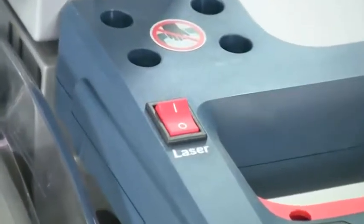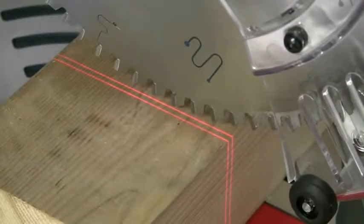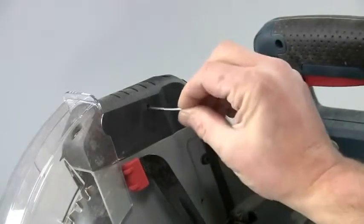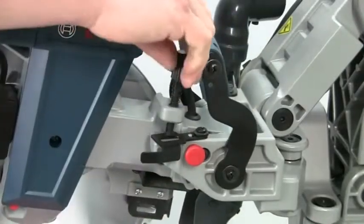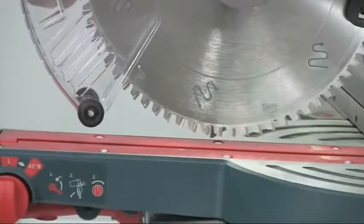To help line up the cut, an adjustable dual laser integrated into the upper guard projects two sharp lines across the full width of the cut to indicate either side of the saw cut. This is so much less confusing than the more normal single line, and you can adjust the spacing of the two lines to account for the different kerf width if you change the blade thickness. A very simple tenoning stop that controls the depth of cut can be quickly engaged for joint or trench cutting.